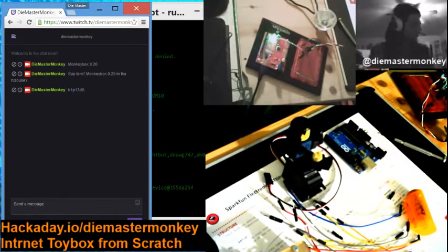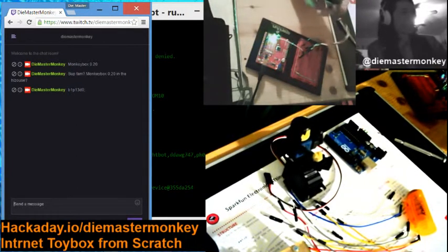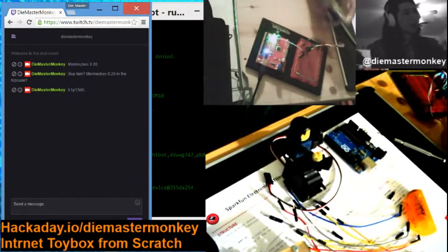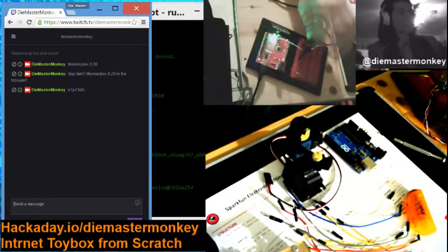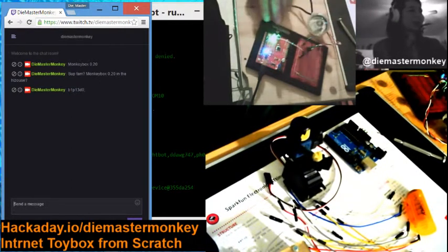Okay, we're back. So you may be interested to know what you saw me doing there. Once I had identified which conductors on this LED mount were which, I found, by the way, that on this one, the red conductor, the power conductor, was actually the positive lead, not the white one. The white one's inactive. So I hooked up the ground conductor to the ground on the Arduino,